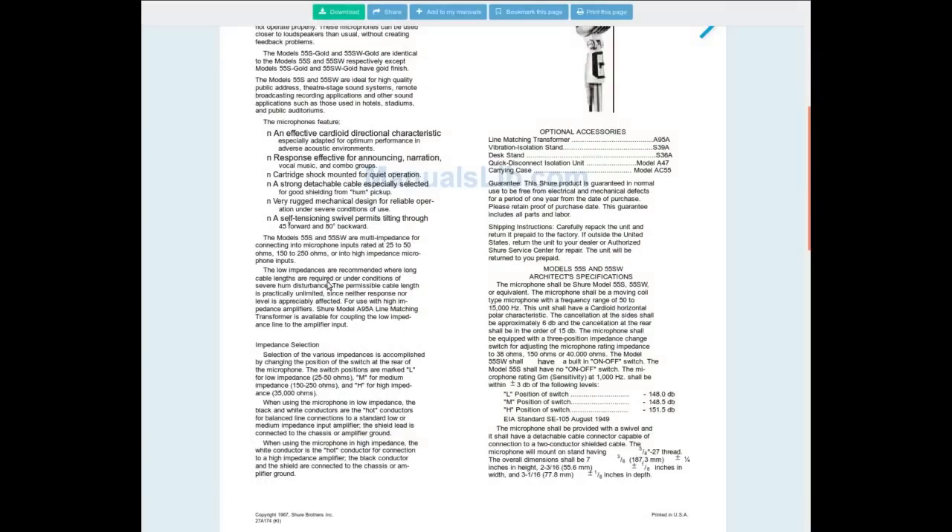So some of the reasons for the different impedances: 150 to 250 ohms is what a typical dynamic microphone these days comes in around — it's kind of become the standard. The low impedance is generally intended for long cable lengths so you don't get as much induced hum into the cable. The high impedance versions were for use directly into a tube-based amplifier, which typically has a high impedance input — that's just the nature of the beast. However, a lot of amplifiers also have a transformer as the first input stage for matching, so tube amplifiers designed for medium impedance, 150 to 250 ohms, would generally have a matching transformer as the front stage.